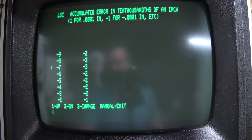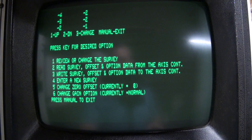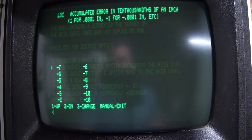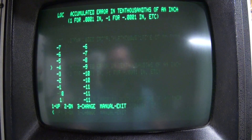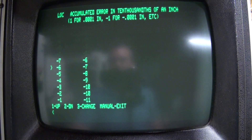When you're done recording, press manual to go back to the screen, then press manual once more to select a different axis. Now we'll do Y — let's review Y. I only have sixteen inches of Y travel, so Y starts at minus seven. Same deal — you can see the Y survey values. I'm hoping to do a future video on how to perform a survey on a machine; I need to work with Brian to bring the laser in for that.